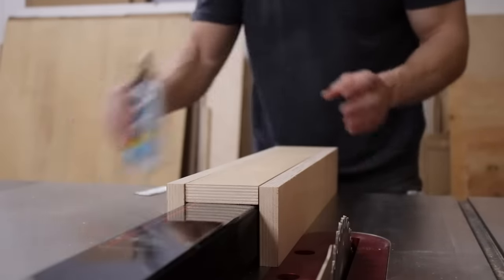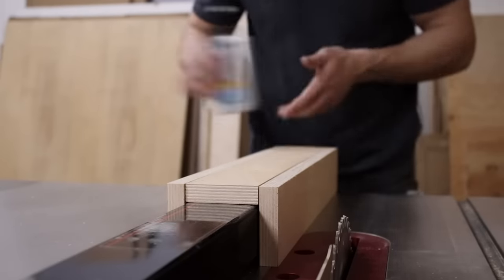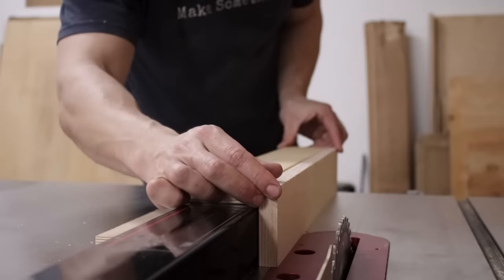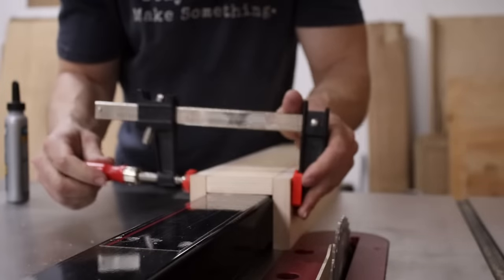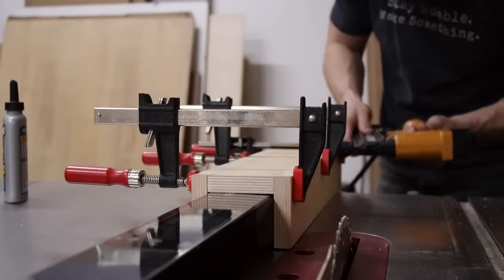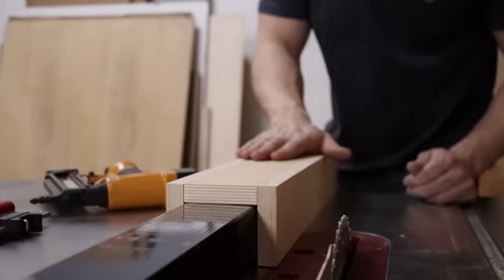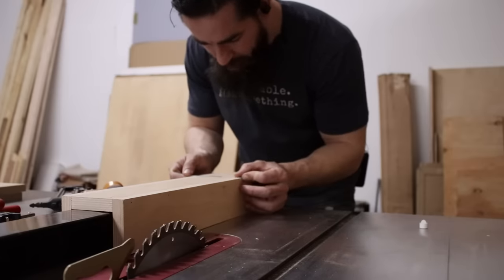Now we've got a nice tight fit. I'm going to tack this together with a little Quick and Thick and some one and a quarter brads. You can use TB1 if that's what you have. You don't need much glue — I don't want any squeeze out on here, just enough to make sure she stays together. I'll throw a couple of clamps on here and clean out any excess glue on the interior. So next up, I want to make the top plate or sill plate. The total width of these pieces is four and an eighth heavy, or maybe four and five thirty-seconds.